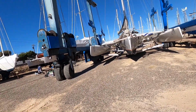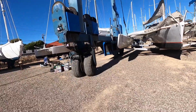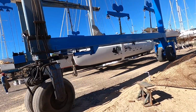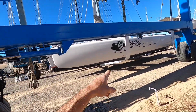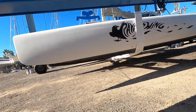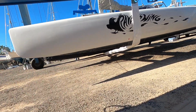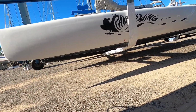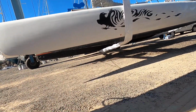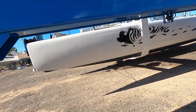Ooh, hope I don't pin my truck in. Plenty of room. See this little red flag? That's where they're supposed to lift from. But I let them move back because the boat was sitting on stands right at the mark, but for this short move. And I know how the tabbing inside there is spread out anyway, so it's super strong either side of the lift point. And then we're going to do something different.